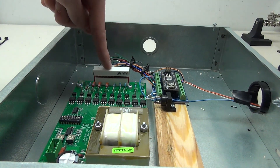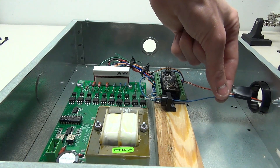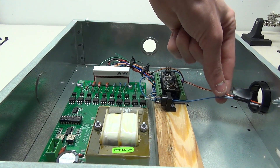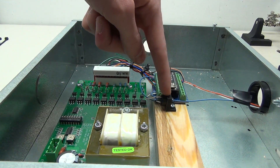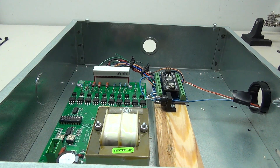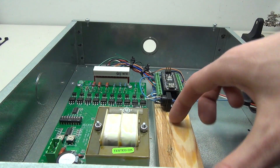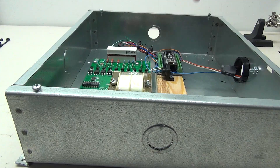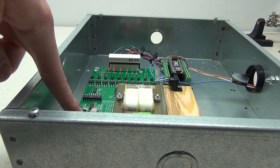The microcontroller is set up. We've got the inputs coming off of the respective ports, the IR receiver input so we can communicate with this, and the little buzzer which we'll use to indicate that something has been pressed. At this point we just have to wait for my power adapter. Plenty of room for that — got to get some wires down here to hook it up to power, and then just hook up all of the indicators.